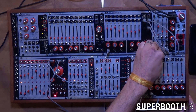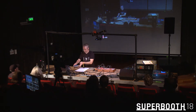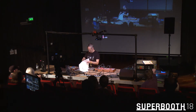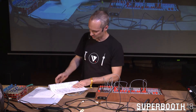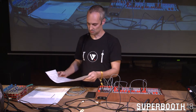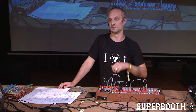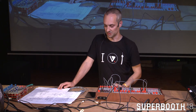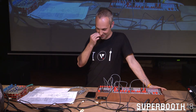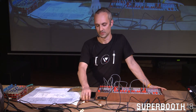In 2001, I got the schematics and documentation from that module. It was kind of interesting that it was more or less impossible to build, because he used this military shift register that was a metal can and was very expensive. At the time I was looking at the schematic, I found it would cost about $80 to buy one — and there are 40 of them in there. So clearly that wasn't practical. My suspicion is that the reason he gave up on the design was because the part became unrealistic to source.